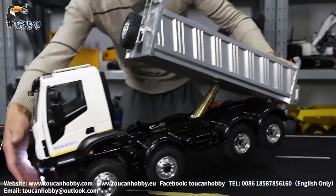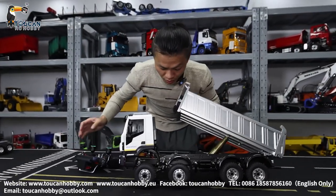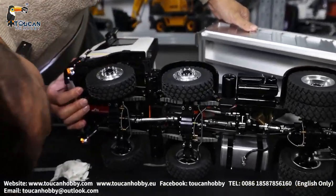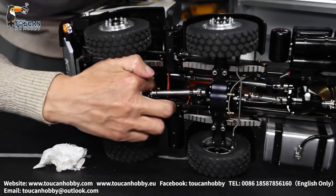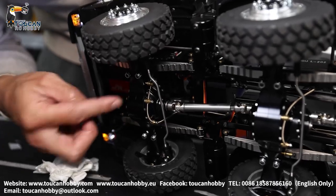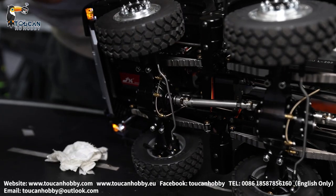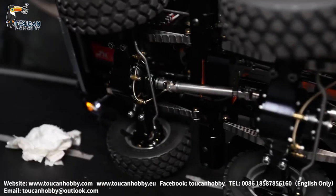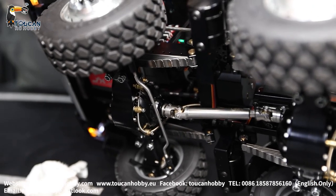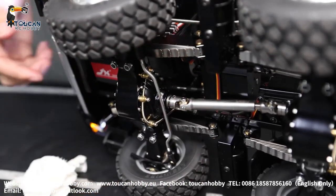That's all the details of the chassis. We have not seen the transmission gearbox moving yet. From this angle, you will see here this connecting bar to the servo — it is inside there, the black one. We will move it: now it is low speed, neutral position, high speed, low speed, neutral position, high speed. That's the transmission gearbox for changing.